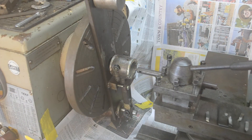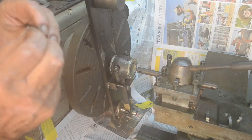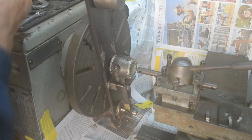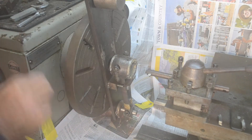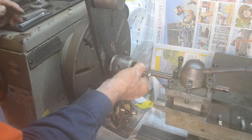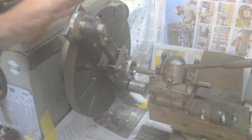Now I can move the carriage up and select the tool. I always use high speed steel for white metal — it's very soft and I can get a very sharp angle, about 20 degrees and very sharp. I use my hone stone here and make sure that's honed right up to a fine edge. That can go in. Tighten the tool up, bring the carriage up, everything's clear, everything's right.